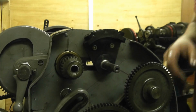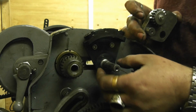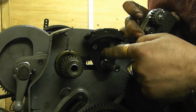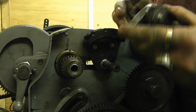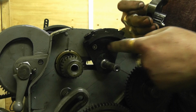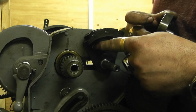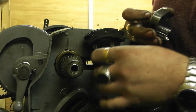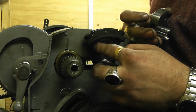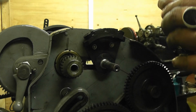Right, that's the plate on. The distance, same again with your design. This boss here stands off a little bit from the back plate, so the back of this plate doesn't rub on the actual body. These are cap screws, and the cap screw head's a little bit too deep for that standoff. So what I've had to do is print these with a recess, so the cap screws sit a little bit further into the actual body of this.